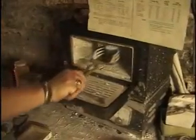Now I'm going to come over here and open up the kiln. With a pair of tongs, I'm going to reach in and grab the right one here first. Okay, there's one right here. There's the end with the holes, you can see those, that's where the metal's going to go. Okay, and we're going to put it in over here in the centrifuge with the metal.